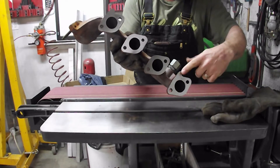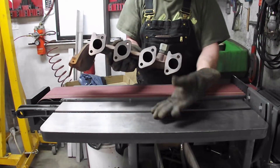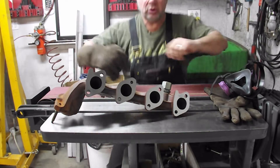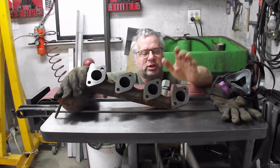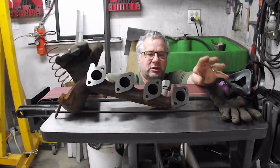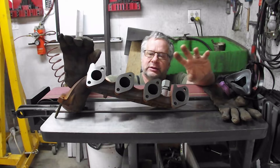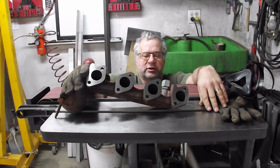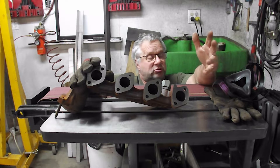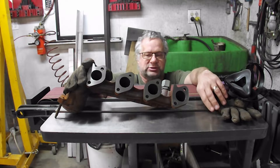There's what we want — we've got full cleanup from all four of these. Going to put a gasket on that, it's a silver head, and this is going to work. One thing I find with doing these exhaust manifolds is castings go through heat cycles — they're cast and they're machined but they don't preheat them or anything. And as soon as they start going through heat cycles they turn into a piece of licorice. Chrysler, Dodge, Ford — they all do the same thing.